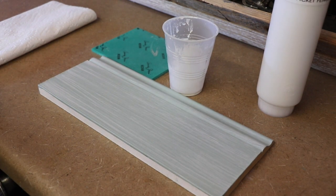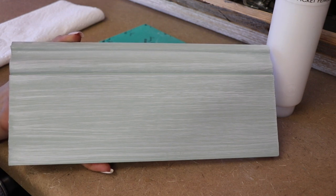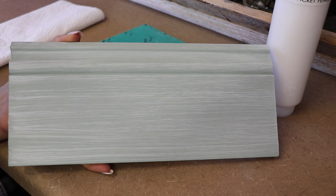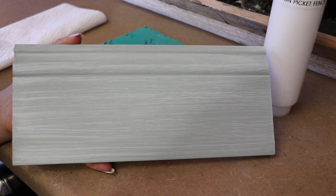It is dry. Whitewashing does not take long to dry because you're basically giving it such a dry brush effect. The pressure is incredibly light — you're literally like dusting it on with a feather. That's how light your pressure should be. Let me zoom in on this and show you how it looks. It looks really nice and we haven't even sanded it yet. Once we sand it, it kind of melts together a little bit and creates a softer look.